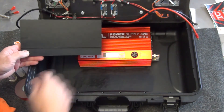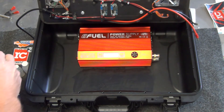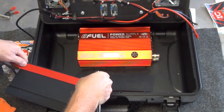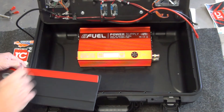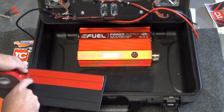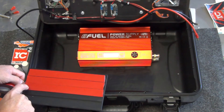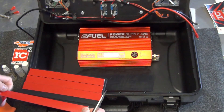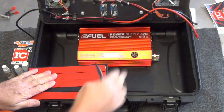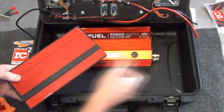Now that the surfaces are dry, you see a little shiny look to both pieces — that's where the primer has dried. Now we're going to take our 3M tape and place it on the surface. Because I have a little bit of primer on my fingers, you'll see this 3M tape really stick to your hands also. Any of you that have ever used this tape before know this is sticking very good just on that little bit on the end where it's touching the primer — you can definitely see how good it's sticking. Once you push it down, it's definitely permanent.